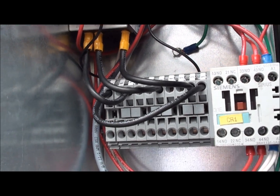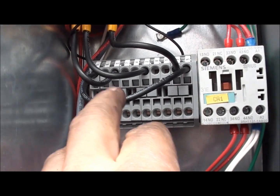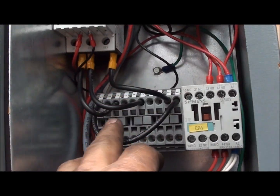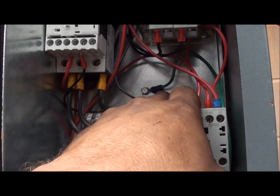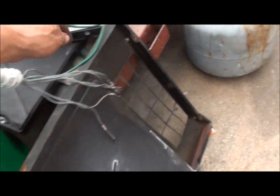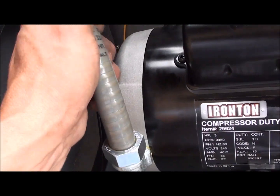Here's something interesting — I'm going to use L1 and L2 and get rid of L3. Looking in here at this wire — it goes nowhere, not hooked up to anything. I went ahead and wired in the motor and replaced the ground wire. It had this huge ground wire on it — you don't need all that. Got that squared away and got the motor mounted with some conduit in here.